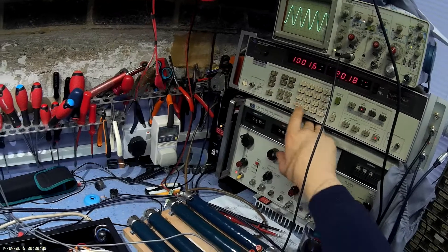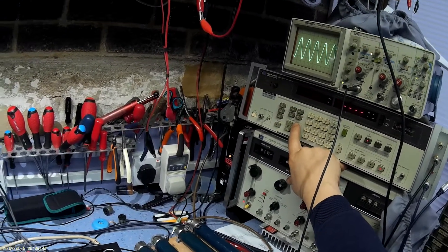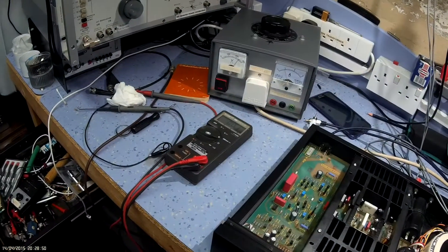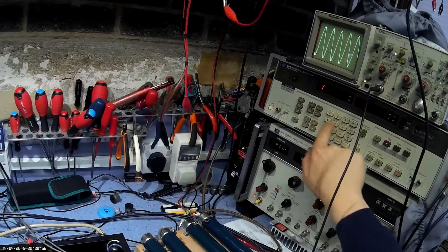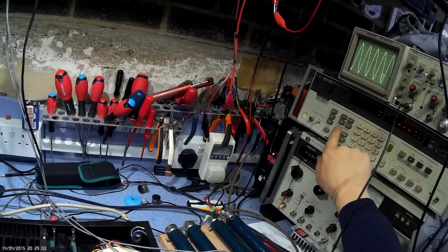Let's make sure amplitude increments are the same — increasing power further. It's starting to sting, you can hear the transformer humming, putting about one amp out of the mains — 250 watts or so input. Reading shows 128 watts and it's not clipping. So there we go — I think we can simply say that's fine. Turn the power back down.